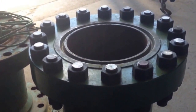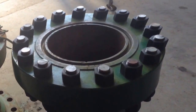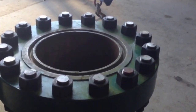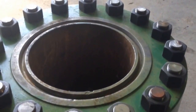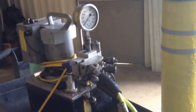What we have in front of us is one of our BOP spools and there's already nuts on it. Usually there would be another spool on top that we'd be connecting together and there would be a ring gasket right in between here. This is one of our defective spools because it has that nice nick in it. Can't do anything about it, but this is our torque pump that we use — hydraulic torque pump.